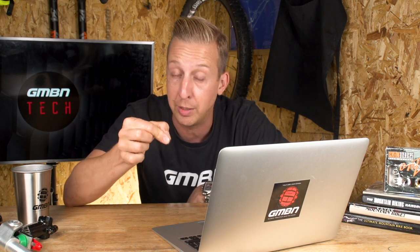But as D says, his fork should read 140 and it's showing sag as 130, which suggests the front end of the bike is sitting slightly lower. This is the typical characteristic of slightly too much air in the negative air spring. There are a couple of ways around this without stripping the fork. The obvious one is to hyper-extend that fork — literally holding the crown and the brace and pulling it apart — and you'll hopefully hear the air transfer back through the port. There's a transfer port inside that, when you pressurize the fork, lets some air from the positive chamber go into the negative. Another way is to use a cable tie to delicately push past the seal on the air leg, and if there's too much pressure in the negative chamber you'll release it that way.